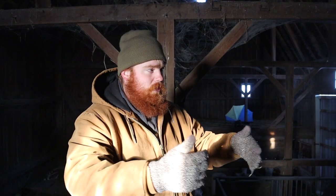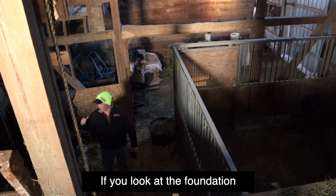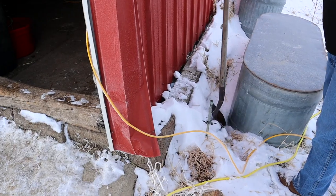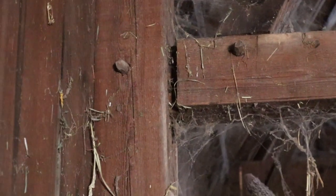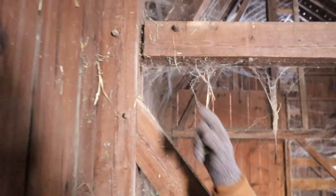According to the owner, there was a windstorm three years ago and the whole barn shifted off the foundation. We had straight line winds, and if you look at the foundation, it's actually six inches to the east. There wasn't a lot of hay in the haymount and the wind shoved the whole barn, picked it up, moved it that distance, took a tree out of the pasture, and threw it into the grain bin. But this is also a great example of how strong mortise and tenon joinery is, because those tenons on the side of the barn that are trying to pull out — that draw-bored peg is holding really strong and is really the only thing holding up this whole section.